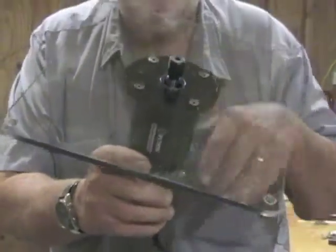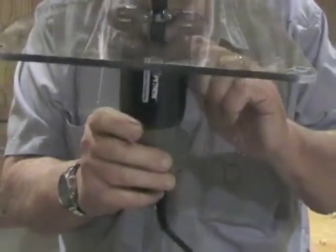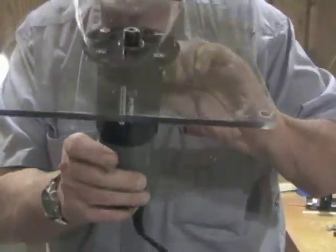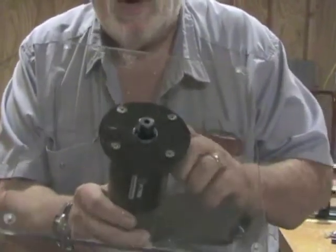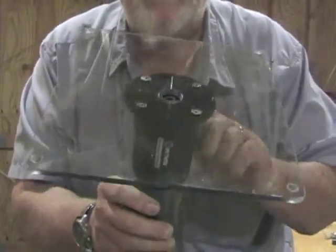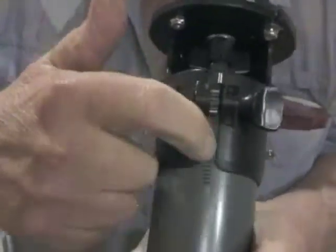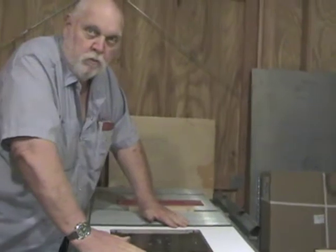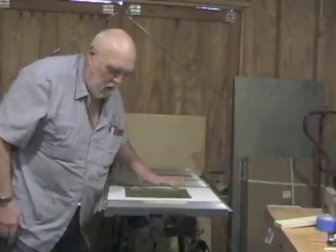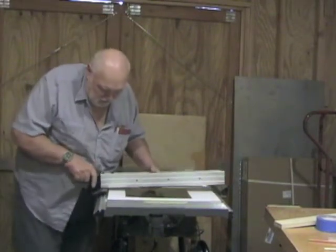Is that the collar for a bit to go in? This is the collet — the bit would go in there, and then it's adjustable. I've got it run all the way out to where you would actually stick it out, tighten things up, and then set it for the right depth by moving it in and out. It's got gear teeth in there. There's another reason I wanted to use this — I wanted to be able to route straight, so I can take my fence from the saw — this would be the side of a drawer — and route a groove an eighth of an inch from the edge for the plywood drawer bottom.